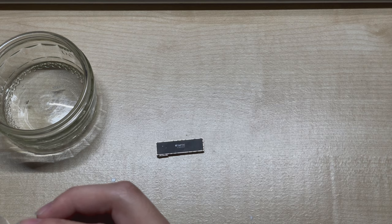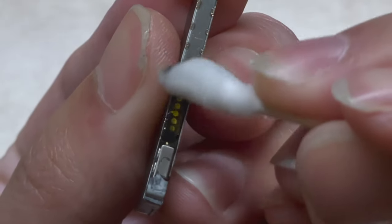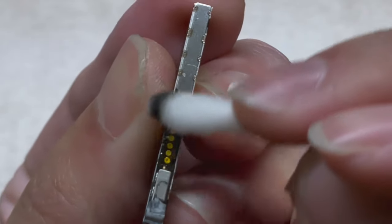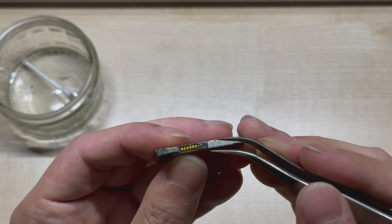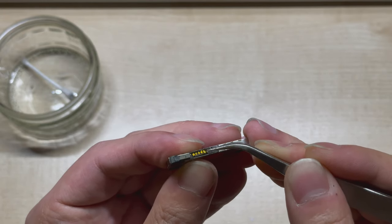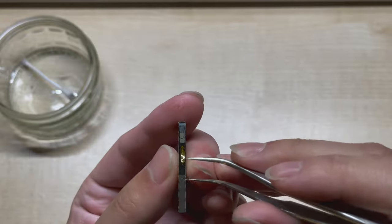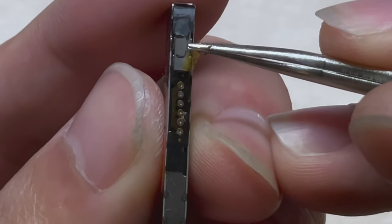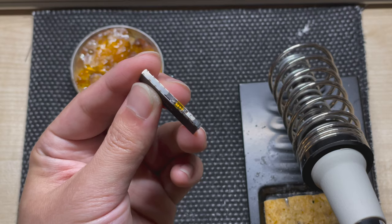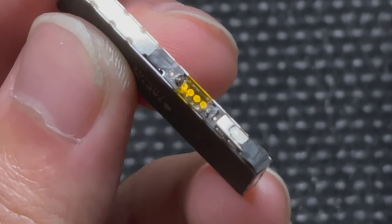As before, we'll be using alcohol on a cotton bud to remove the tape covering the hidden diagnostics port — just gently wipe. These pads are still hidden under a layer of Kapton tape which we need to remove. But we need to be very careful because this is still on the back of a very fragile ribbon connector and if we pull too hard there's a risk of puncturing it and damaging the connections. So take your time and just gently pull upwards. On the diagnostics port we will be using the first and last pads, so I've used Kapton tape to cover up the ones in the middle and pre-tinned the pads. Now it's time to attach the wires.